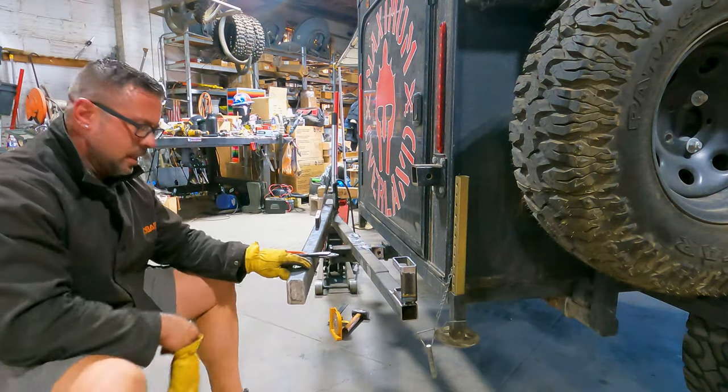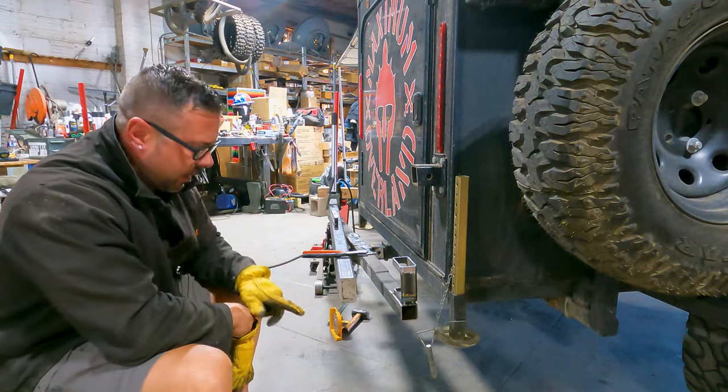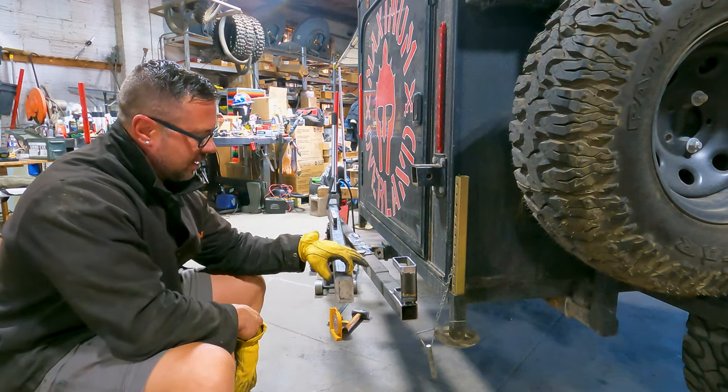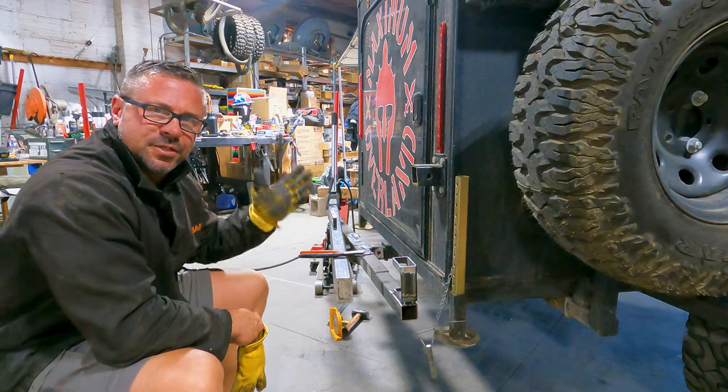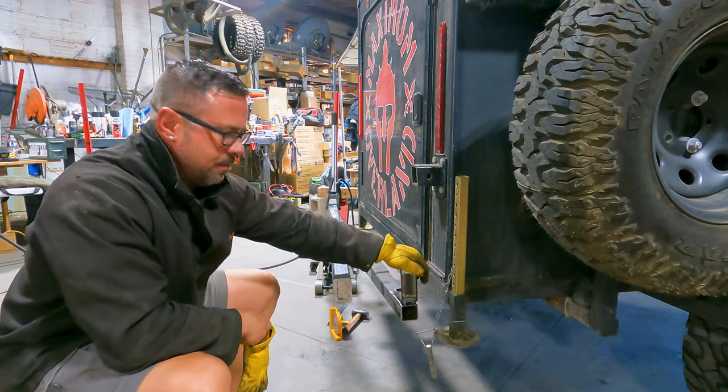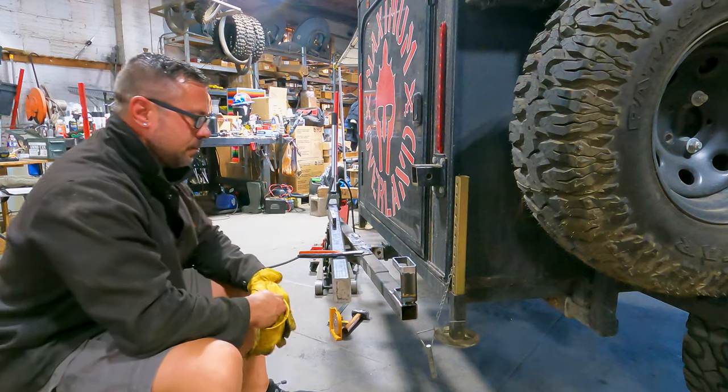So you can see off camera, basically what I did is I just made some caps. All you do is take this same pipe, put the pipe on top of it, trace it out, and then cut it with your cutoff wheel. Super easy. Put it in the middle, then I just welded it flush. And then I went ahead and built the capture and put it on here.